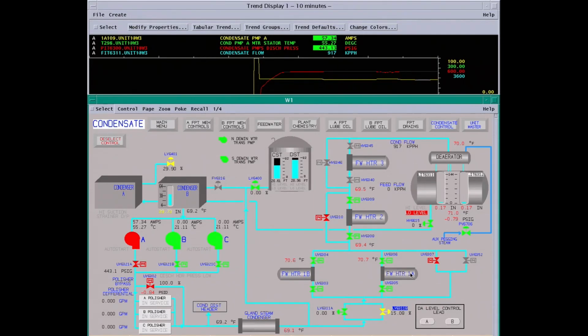So we've expanded the steam and a lot of the heat energy has been extracted from the steam, so we can recover the rest of that energy and reheat the feed water. So this really increases the plant efficiency. Feed water heater 2 is coming off of stage 19, which is warmer steam than 1. And 3 is warmer than 2, so the steam has to be extracted as it expands. Your last stage of the turbine would have to be too large to deal with it. So we expand the steam through most of the turbine, then recover the energy instead of wasting it in the condenser, reheat the feed water. So this helps improve the plant efficiency.